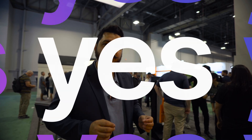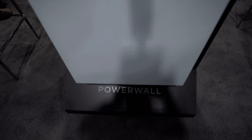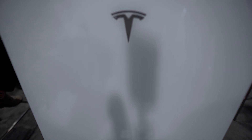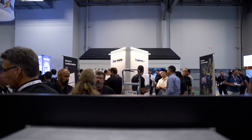There's still a lot of information to come, but here's one of the biggest things a lot of people have been speculating: is it LFP — lithium iron phosphate? And the answer is yes. This is huge news for the industry because with all the regulations from the National Electrical Code, the California Electrical Code, and residential building codes, installing batteries that are not lithium iron phosphate has become very difficult. The Powerwall 2 unit, which is AC coupled, has to be three feet apart, and that's really hard to accommodate on a home. So the fact that Tesla is switching to LFP is phenomenal.